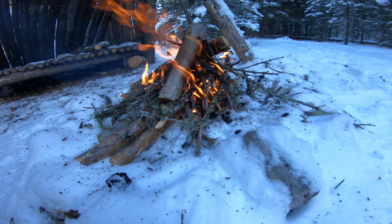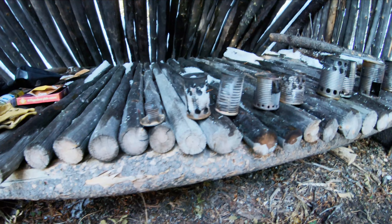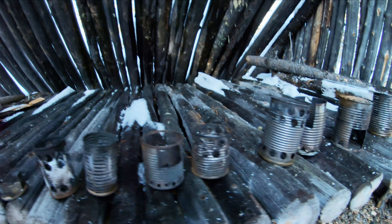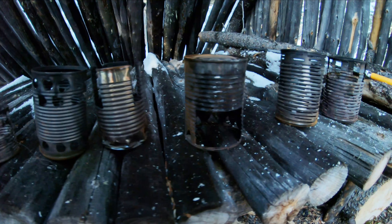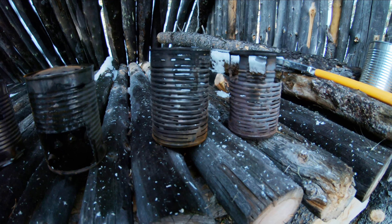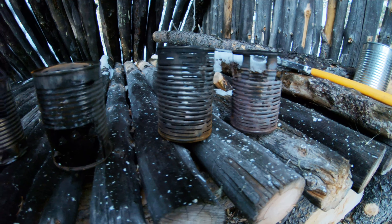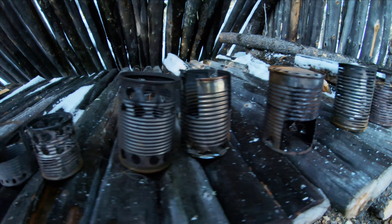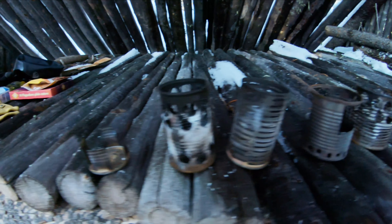Here you can see sort of the evolution of the stick stove. We tested a lot of different types of stoves with a lot of different designs, but they all had some inherent issue where they just weren't trapping heat, and in most cases they weren't getting enough oxygen — that was almost always the problem. You can see the can stove here on the far right; that's the one we ultimately came up with. The slits in the bottom provided enough oxygen for the fire to burn at the bottom, but it also had enough metal on the can to reflect the heat back into the center, which kept that fire hot in there.